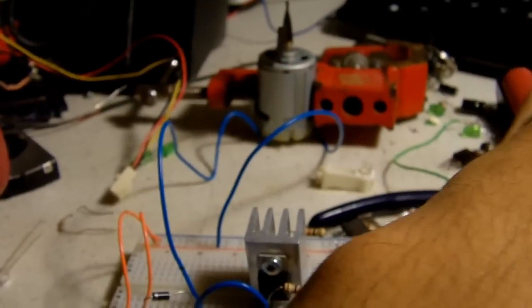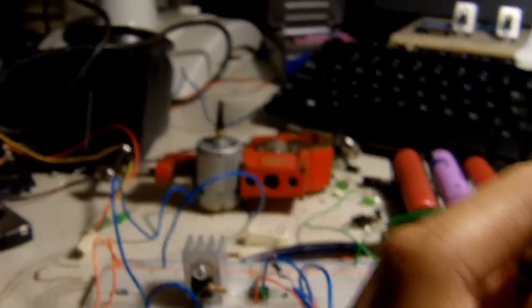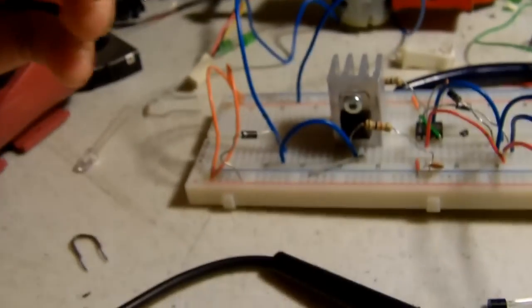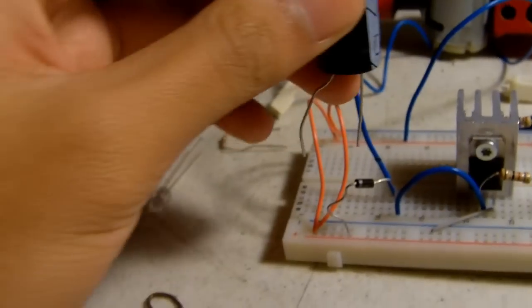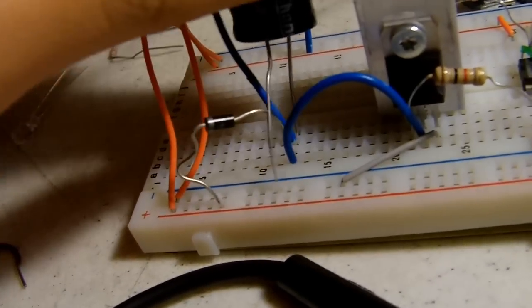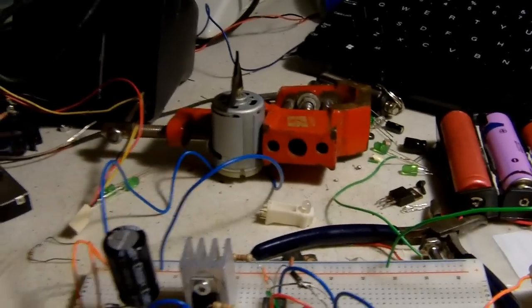I added leads to my potentiometer so I can control it easier. Let's turn it on — you'll hear a buzzing. The buzzing changes as I move the potentiometer up, but it can still power on. If you want to get rid of the buzzing, connect the capacitor going to the negative rail that we made, and connect it to the main positive. Turn it on and there is no sound.